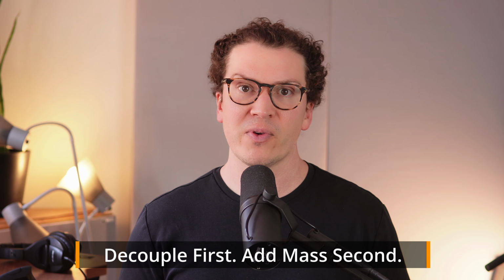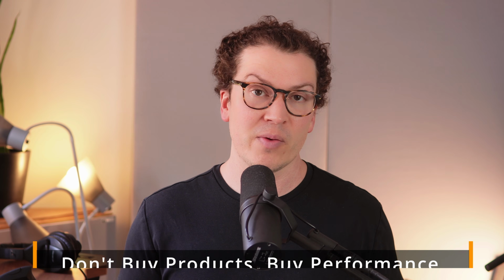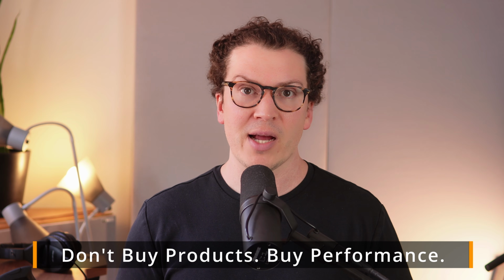So I hope that this video brings some clarity to the debate that I've had internally over the years, and maybe you guys have had out there on the internet, of what green glue is good at. And it's really, truly good at helping with a system that is not decoupled. So it's sort of a band-aid to an already not so great situation. What we do at SPYS Designs is we would never do that. We always decouple first, and then we add our mass second, in which case green glue is really never going to be an option for us in any of our designs. And that's what I've been saying for years. And now I hope it's backed up by even more data and science behind it.